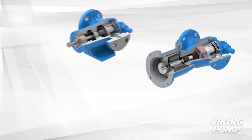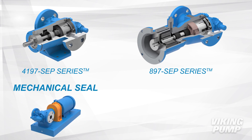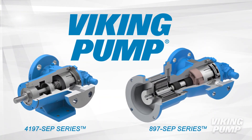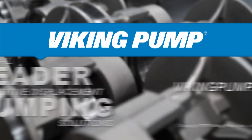There are a couple of differences between Viking's SEP series pumps so customers can find the right pump that fits their needs. The 4197 SEP is mechanically sealed and base mounted with an explosion-proof motor, while the 897 SEP is magnetically sealed and directly mounts to the motor. When it comes to cold ethanol hemp extraction, Viking Pump offers two proven solutions. To learn more about the 4197 SEP and 897 SEP series pumps, visit our website at VikingPump.com.